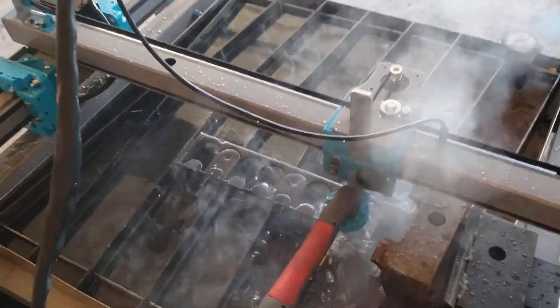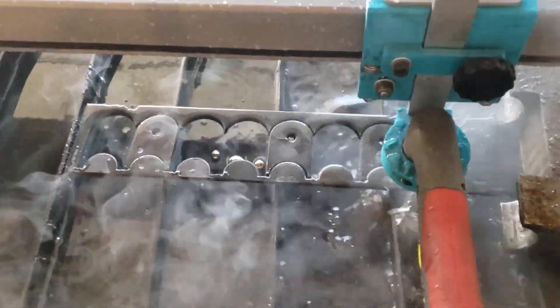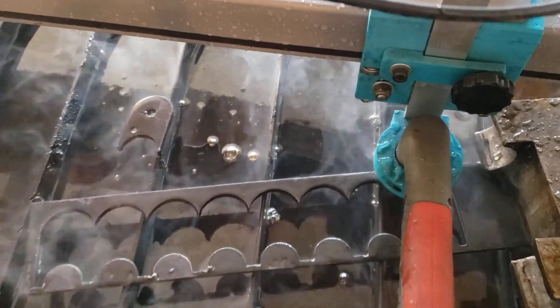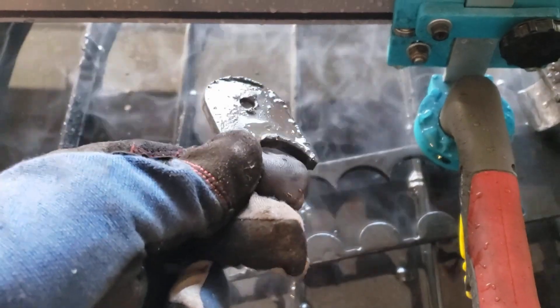The ones that happened to be sitting on the slats — I'm sure they're loose. If I just pick it up a little bit, yep, they're all loose. So it looks like we've got a pretty good cut here, just minor dross to clean up, a little bit of things to knock off — real nice edge.